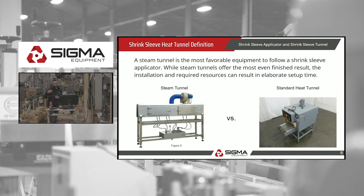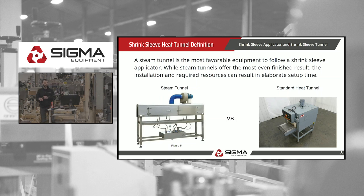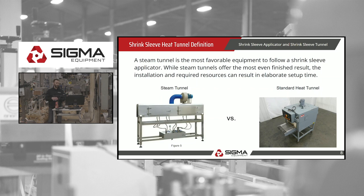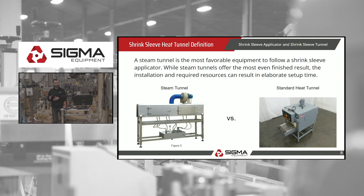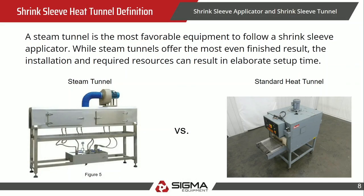After that plastic film is over the container, it needs to be shrunk to conform around it. That is where your shrink sleeve heat tunnel comes in. What makes a shrink sleeve tunnel different than a standard tunnel is that most of the time you're going to be using steam instead of just electric heat. Water transfers heat about 20 times faster than standard air, so if you're sending a plastic bottle through, you don't need as much heat — too much would melt and ruin the product.